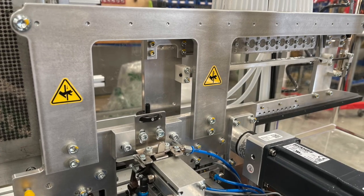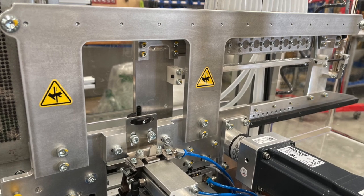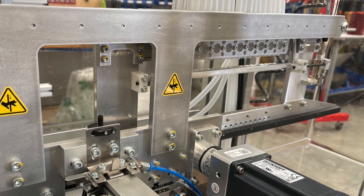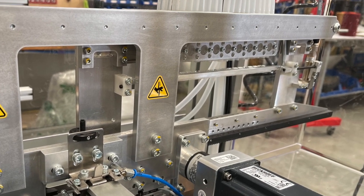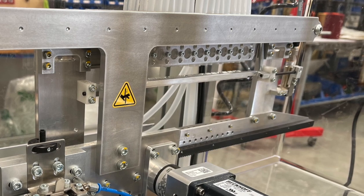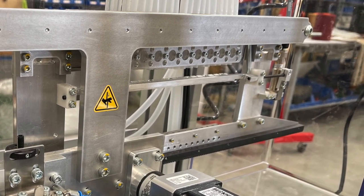On the colour bar, we've introduced a knot detection system. When knots enter the colour bar, they can jam the colour bar and necessitate the removal of the colour bar to take the knots out, or there's a chance we can damage the needles. So, knot detection system on the Kibbe G6.